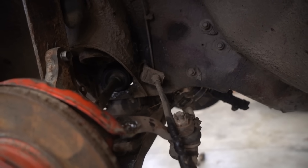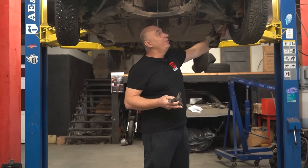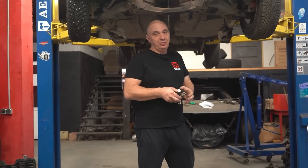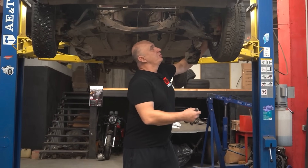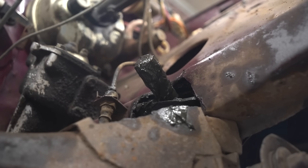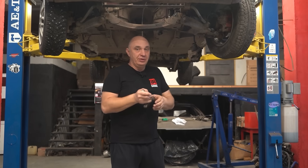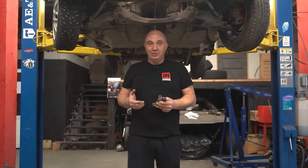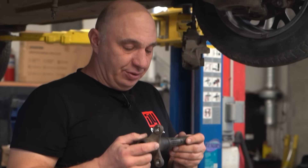So we've torn down the suspension and then rebuilt it. Everything is looking good — we've installed the wheels and all of that. And now we're going to be working on the propulsion system. You'd think it would be simple, but it's really not. The reason being that when the wheel turns, the axle shaft needs to change its length. And to avoid a situation where it would press up against the motor and break it, we need to set up a spline connection of this sort.